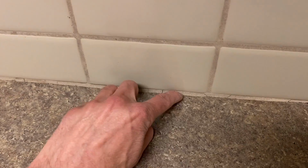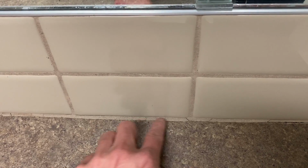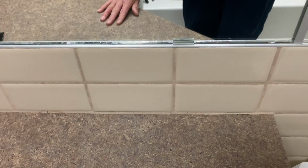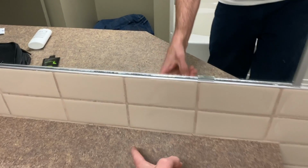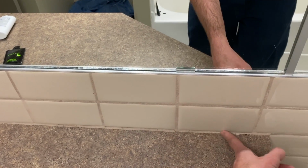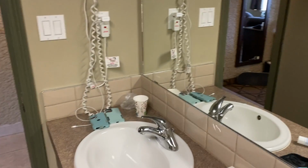But overall, the tile, okay, there's something to learn here. This is why it's usually a good idea to use the grout in a tube, like it comes in a caulking tube. So you pick a color that is pretty similar, and then you grout this bottom one with flexible grout-based caulking, so that you don't have that happening. And other than that, we're all done.